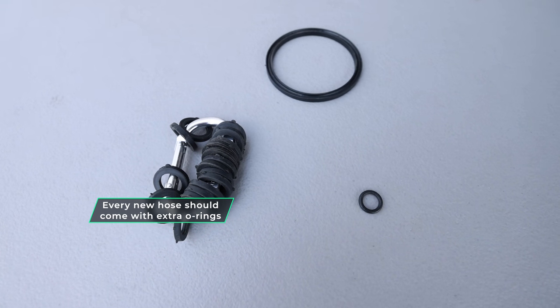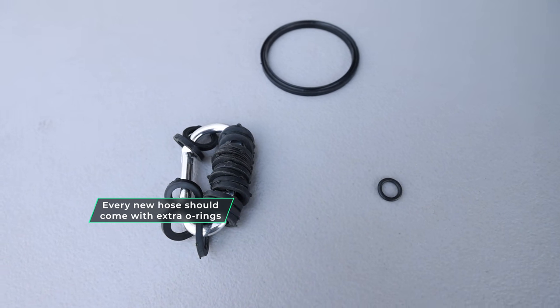Also part of plumbing, things that we carry are O-rings — the little O-rings that go on your hose fittings. It's a good idea to have those. They wear out, they fall out, sometimes you've got to double them up. If you've got a hose bib that is real shallow and you can't get it on all the way, it's good to have extras. But more importantly, you want extra O-rings for your sewer hose.